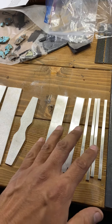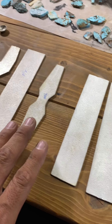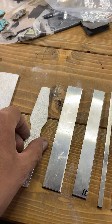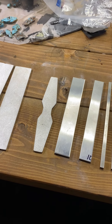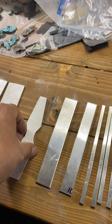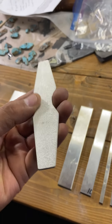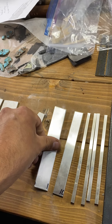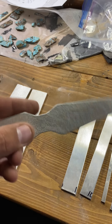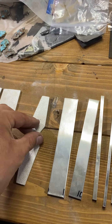People do great work fabricating — I do fabrication too. This manufactured blank is comparable to my cast piece. If I'm making bracelets and want to fill orders within a year — last year I filled 250 or more orders — that's why I started taking some of my masters and having blanks made. I call it a bracelet blank because it's a piece of silver pre-formed, ready to make into a bracelet.